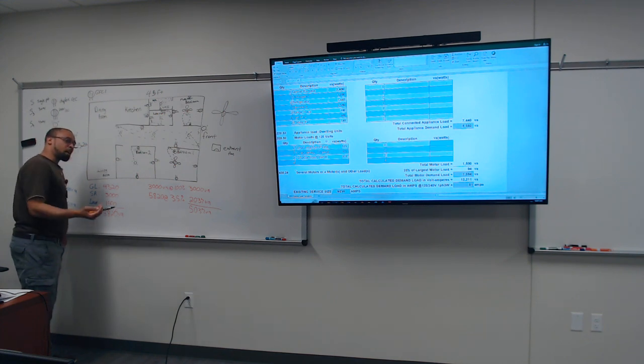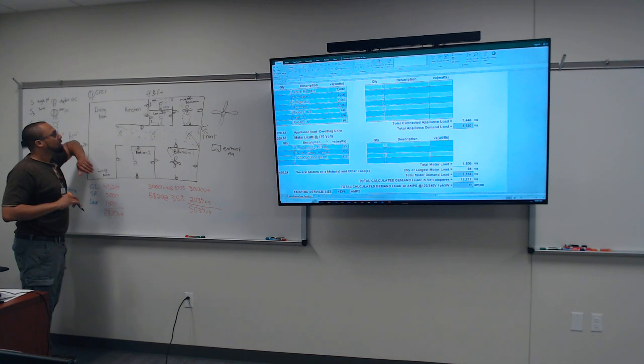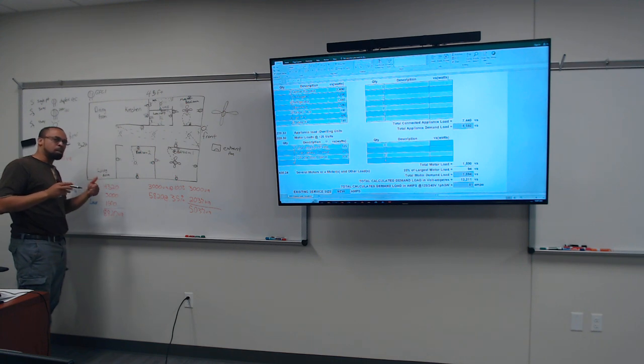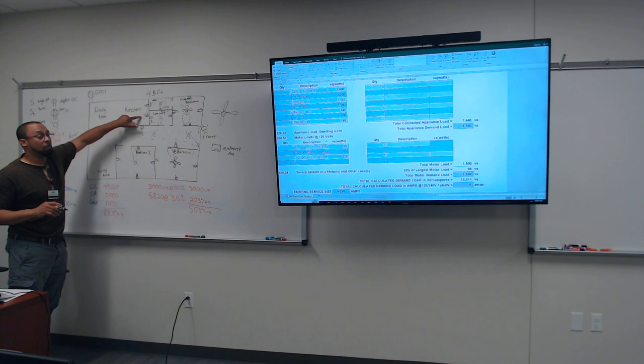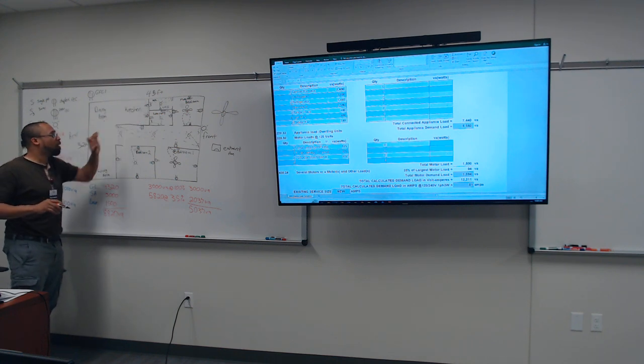Your final draft. Yeah. Now, what you just said is correct, right? But for this purpose, it's just to get the general idea for the lights and the plugs. All right. But yes, when y'all do what Mr. John just said, when y'all do your final draft on that more complex diagram that y'all have, if y'all want to put the disposal or extra stuff for the trash compactor, then you do those things like that. Yes, sir. Would that be covered under those two small appliance loads for the kitchen? Yes, anything in the kitchen is gonna be too small. But you still wanna put a GFCI because that's next to the sink. I'm assuming that the sink is gonna be right here. Well, yeah, sink might be right here, but this right here is gonna be for my sink. I should have probably spread that apart, but y'all get the idea.